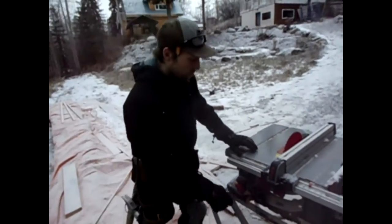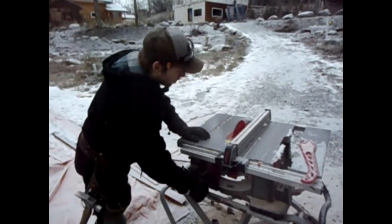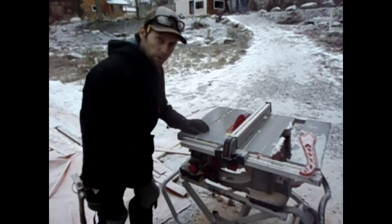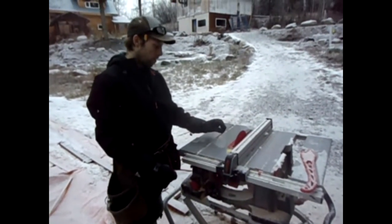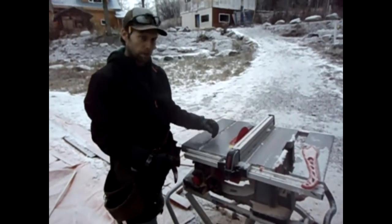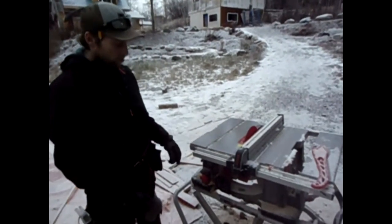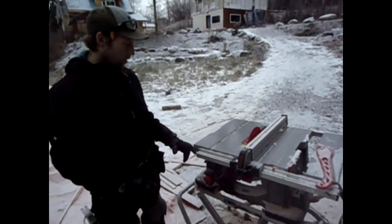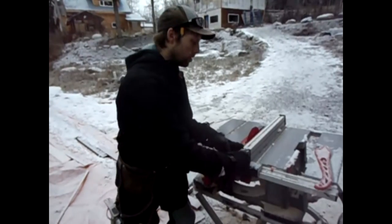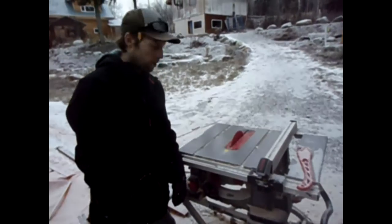The wheel right here raises or lowers the blade. You generally want your blade to be about a quarter inch to three-eighths above the piece you're going to be ripping thickness-wise. Now we're going to go do some freehand bevel cuts and we'll explain why you would want to do these, then we'll dig right into one.